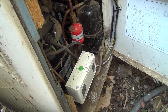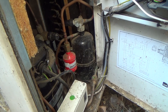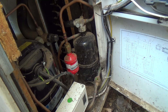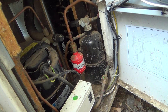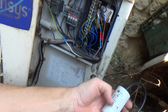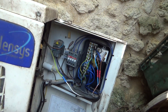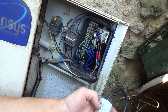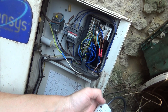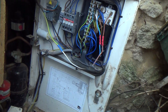High or low? The low one was going off too high. We got a bit too much liquid in it and took a little bit out. Also, it could have been going off on the klixons because there's basically no start cap to give it a kick, and there's no run capacitor to keep it running nicely - so that will make the motor run hot and pull too many amps. That accounts for the fault.